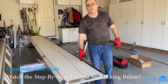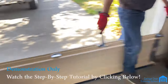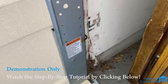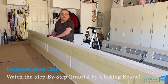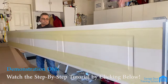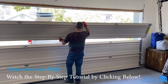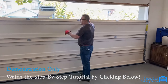Now we begin stacking the door starting from the bottom. Once you've got the door centered in the opening where you want it, you toenail it just to hold it in place, one on both sides. You can basically just start stacking after the bottom section is in — you can just stack them up.